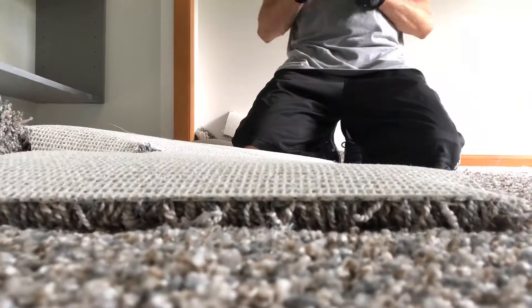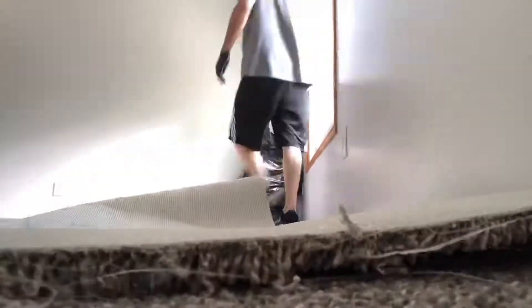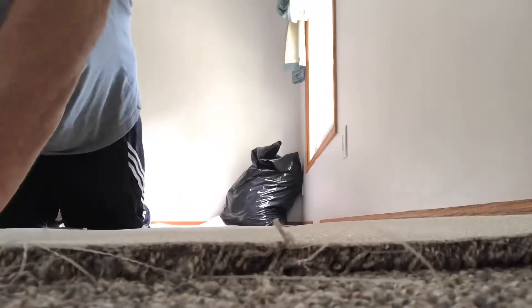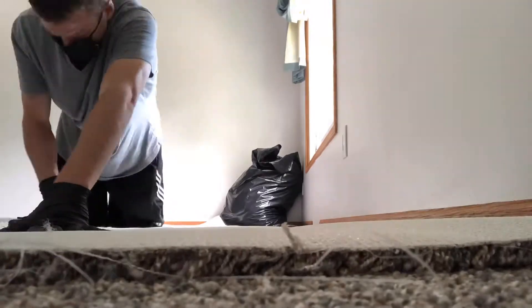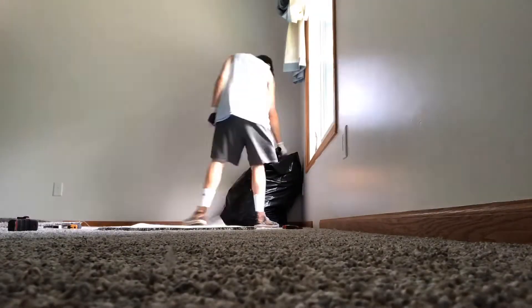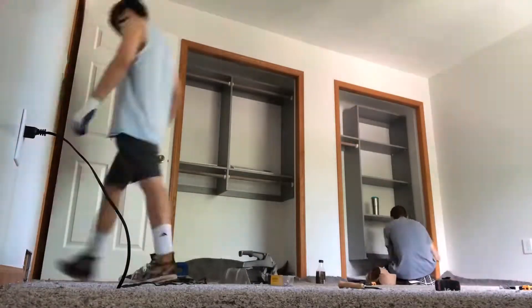Here's the two closets. For a 12x15 piece of carpet, there was a whole lot of seams in here — two closets with seams in there. We actually quarter-turned the closet fills because it saves the client's money and gives us the ability to do one-piece seams versus two-piece seams. Very much frowned upon by many professionals in the industry, but hey, if the client's good with it, you're good with it, everybody's smiling, you go on and make those things happen.